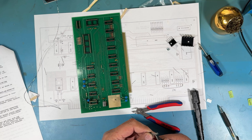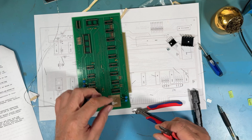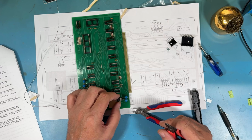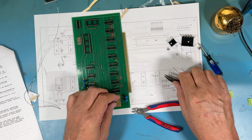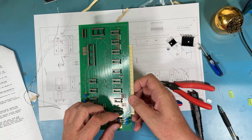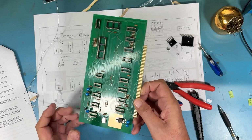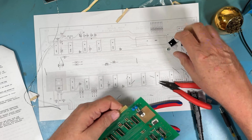And same about distance here. The center one is going to have a much tighter bend. I'm lining up on the screw hole as I look to judge where these get bent. The center one actually gets bent back in the wider part here of the shoulder. Get it to drop down in there. I'm just going to flare the leads a little bit to hold it in place, because I've still got to be able to get the heat sink up underneath it.